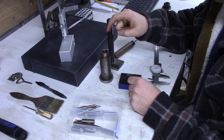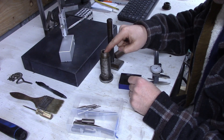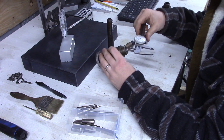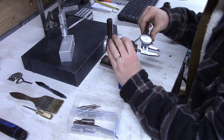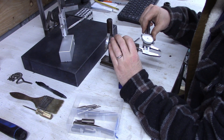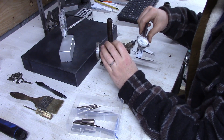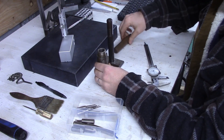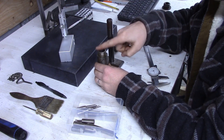Aloris uses a three-quarter inch fine thread rod for this, so even if I bought the Aloris one it's still undersized — that's 750 thousandths versus 720 thousandths. So I'm kind of leaning towards boring this out to fit.